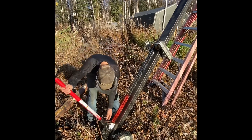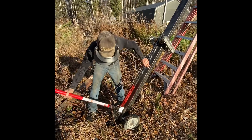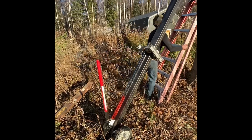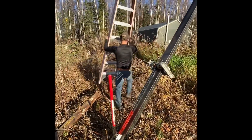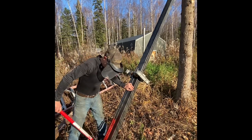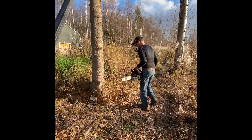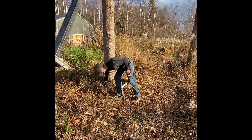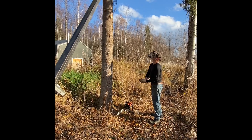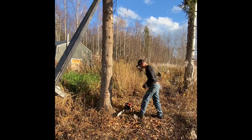Now you want to get a little bit of tension on your jack. Make sure that you're nice and solid. I'm up against a mound here — they're not hard to find in the woods. I'll put a little bit more tension on this, just when it gets to pushing it in the direction we want it to go, just the same as you would normally do to fall a tree. Everything else is pretty much the same. Except as you angle cut it, you'll jack it to shift the weight in the direction you want it to go.